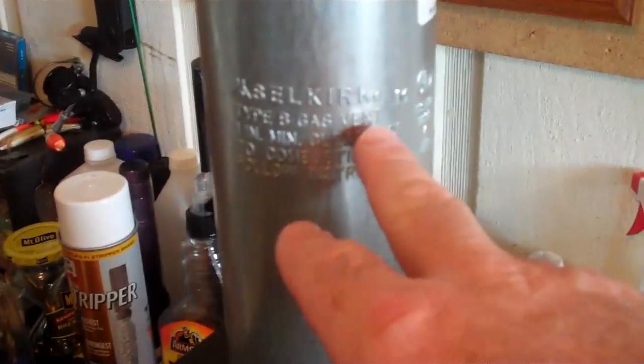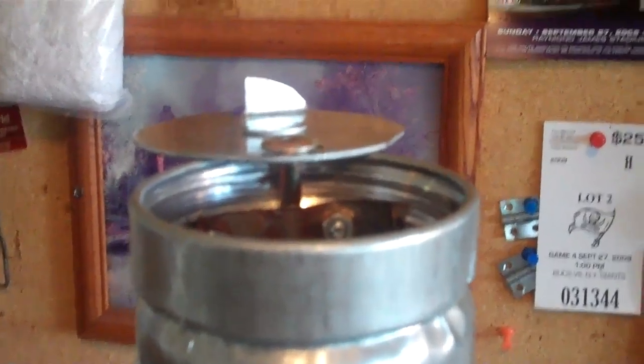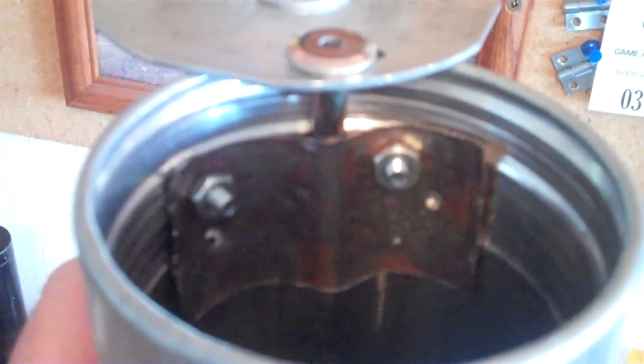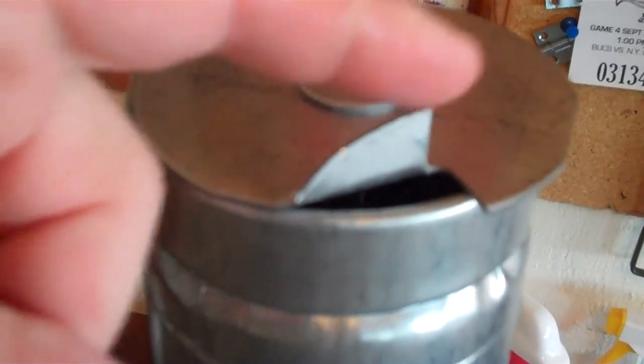Came up with another idea. Now this is a Type B gas vent. It's double-walled construction, which is kind of nice. It should help keep it from getting quite as hot, and it actually goes into the stove itself. I devised a venting system as well, and you can see in there a fabricated bolt. Because it's double walled, I was able to punch a hole through the inside wall for that bolt and drop it down. This is just a standard stainless plate cover for an electrical box, and I bent up the tip there so you can use your knife or a stick to open it up.